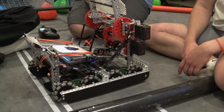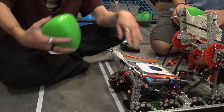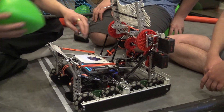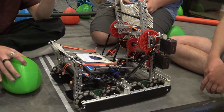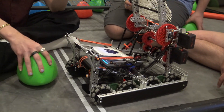To build a puncher you need contact on the ball with such a short stroke length, so we switched to a slingshot so we can have the long stroke length instead of having to impact the ball. With the long stroke length of the sled we can pull it back and it's easier to launch, rather than needing a hard impact with a shorter stroke length.